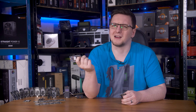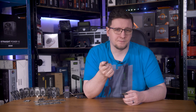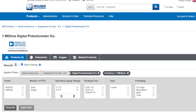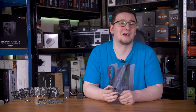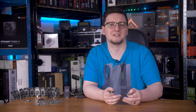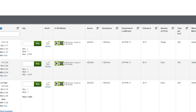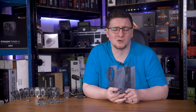As background for why I designed my own digital potentiometer instead of using a stock one: there were two main problems. The first was that the largest digital potentiometers were only rated for around 1 megaohm, and that just wasn't quite enough. Second, and the more prominent issue, was that after I acquired some of those pretty rare 1 megaohm digital pots, I realised they have an insane tolerance. The one I tested measured at just 750 kilohms, and the actual rated tolerance was a shocking plus or minus 30%. That would mean each OSRTT Pro could swing by 60% in resistor values, and that just wasn't acceptable. So I designed my own solution.